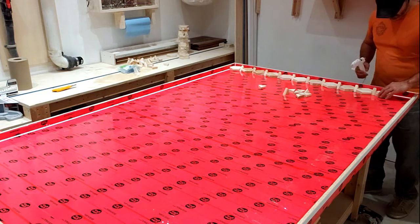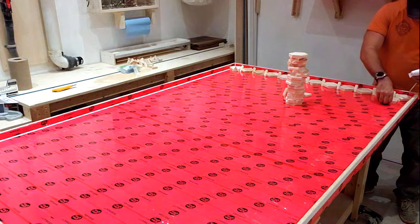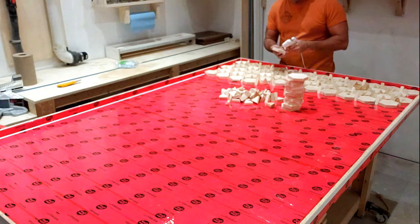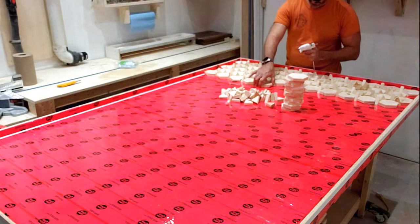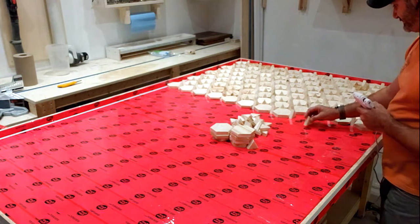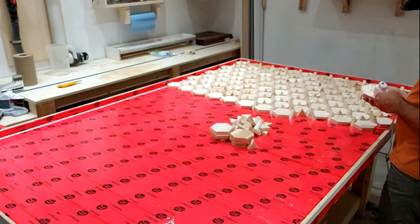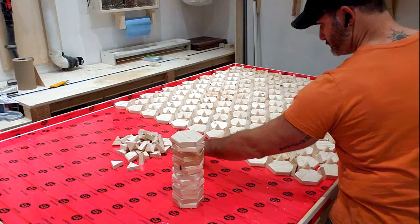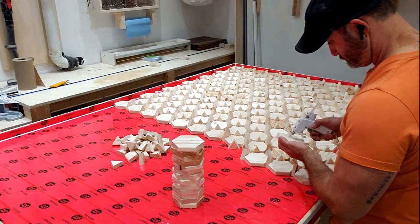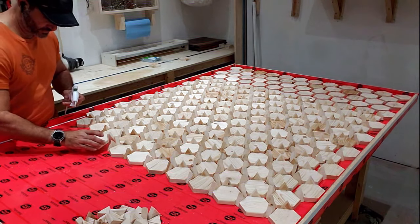I wasn't sure how I was going to weigh these pieces down, because if I didn't secure them, once I poured the epoxy in they were all just going to float away. So I needed a way to lock them down and I decided to use hot glue — this worked amazingly. My only suggestion is that you don't need a lot; the slightest dab will be enough to keep whatever you're doing held down to the table long enough for your epoxy to dry. I used a bit too much on the first couple rows and it made it difficult to get off. As you can tell, those little end-cut pieces are a really good distance to put in between each hexagon, which gives you that nice, cool-looking honeycomb pattern.